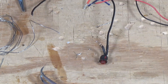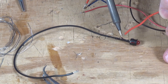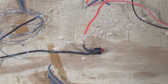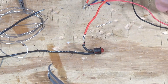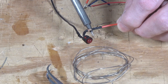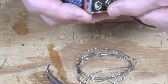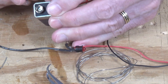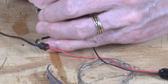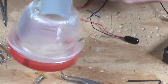Now that's ready to go in. I need to add a red wire here and make this final connection. I'll slide a piece of heat shrink tubing into place and shrink it down. This heat shrink tubing I use is polyolefin, not PVC — you can rub it with the tip of a soldering iron to shrink it. If you do that with PVC, it will melt and you'll regret it. I'm going to go ahead and test my connection on the LED to make sure it lights up with the 9-volt — and it is lighting up. You probably won't be able to see it because of all the light, but it is working.